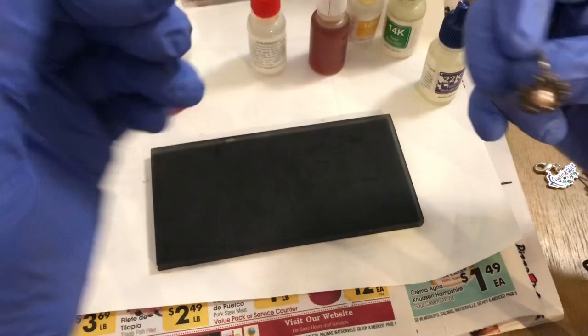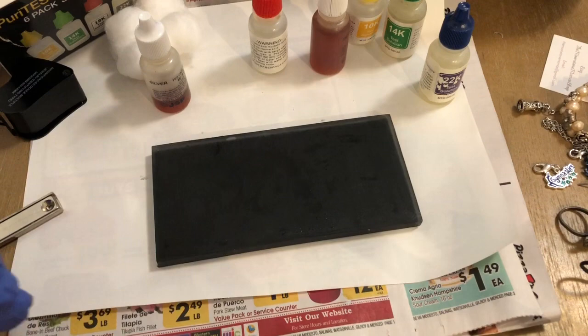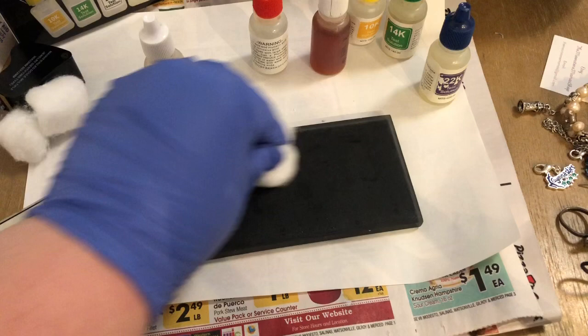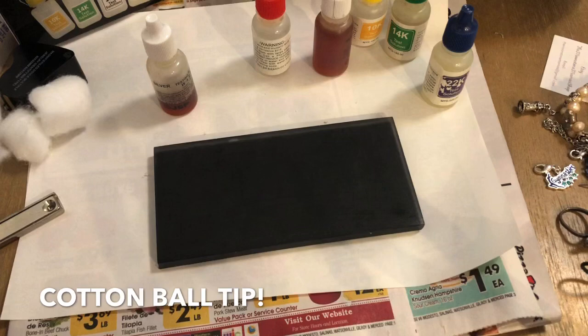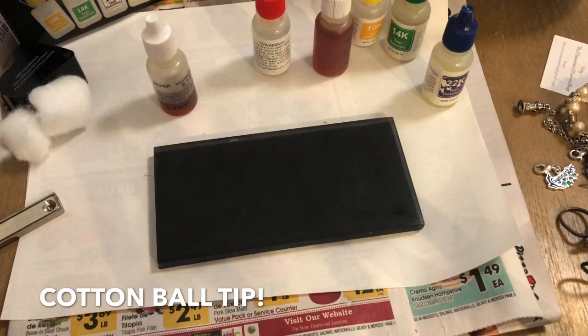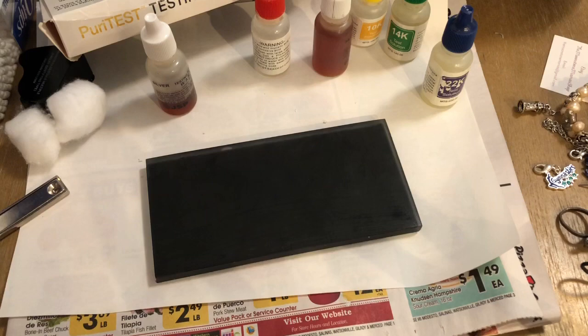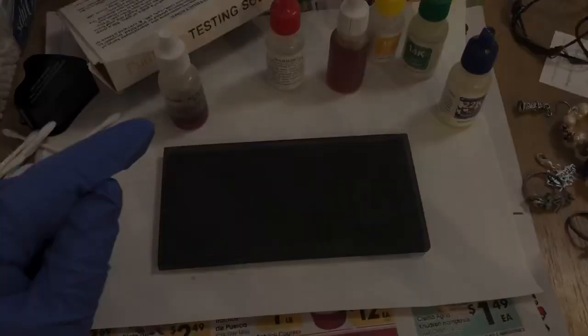We're going to check on our board — it's getting there, a little dry. If you're impatient you can fan it, because you're just wanting the acid to dissolve. You don't want to use your board when it's wet. Since I'm an impatient Irma, I'm going to go ahead and wipe my board down a little bit with cotton balls — I'm pinching the top and moving side to side with no acid contact — and toss them. It's getting better, there's still a little reflection, so I'll wait a bit longer. Get a bunch of q-tips and have them close by.